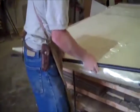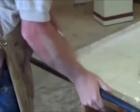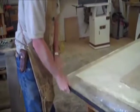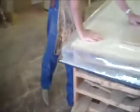The other end of this is crimped off, and we crimp this end off too. I have behind me a vacuum pump — it's all up to its full vacuum. Now you can see the bag is sucking down, and that will clamp that onto that piece of plywood very, very well.